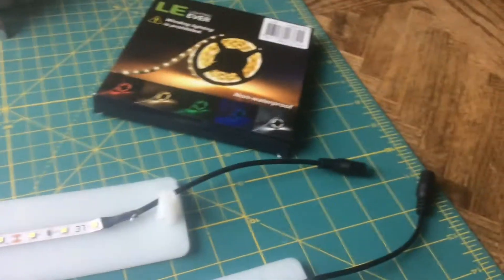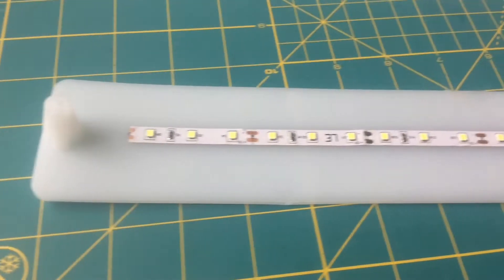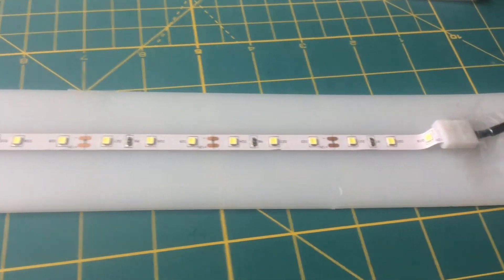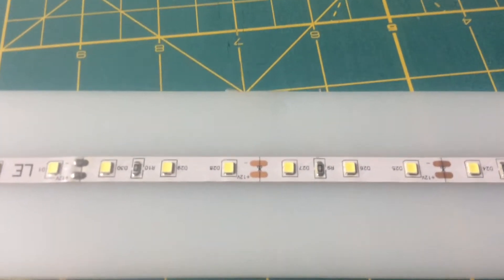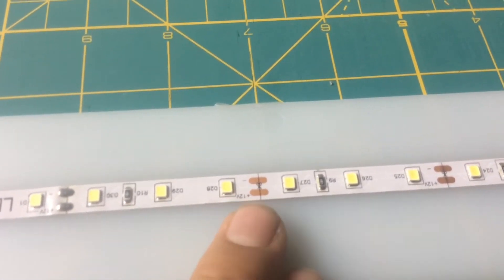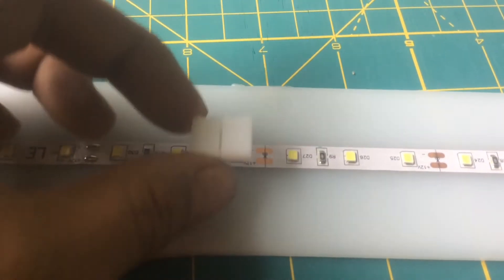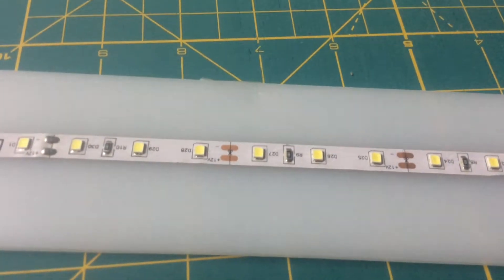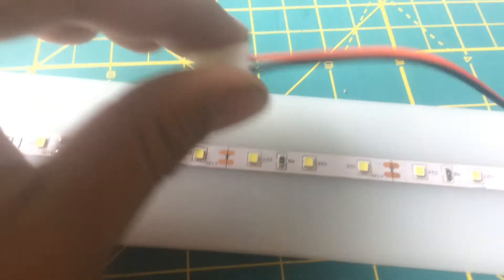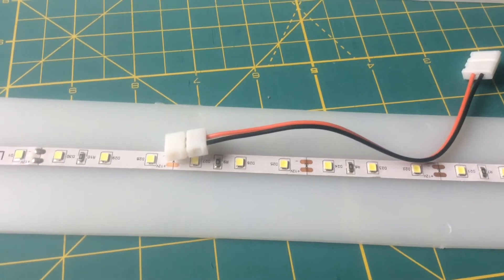You can use any 12-volt adapter you want — buy one off Amazon; you don't have to get the one that comes with the kit, that's sold separately. I had to cut this one down, which is really easy. You can see the scissor mark right there — you cut along this line. Once you do that, you can attach this connector and it will connect to another light strip using only one power source. I wanted to make connections so I could use just one power source.